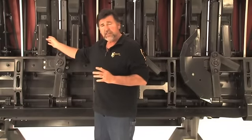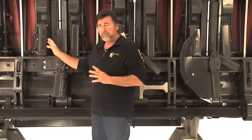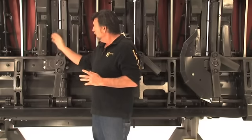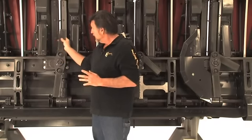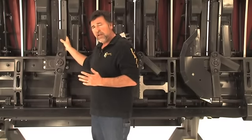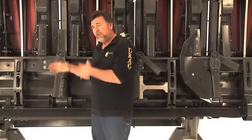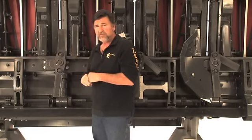First, our stationary knife, a single stationary knife, been around quite a while. What that can do for you is add a little more cutting edge. As the stalk bends over, it catches that edge, which gives you a little bit more chopping quality. It's simple, a little bit more horsepower, but probably one of our oldest options we've had.